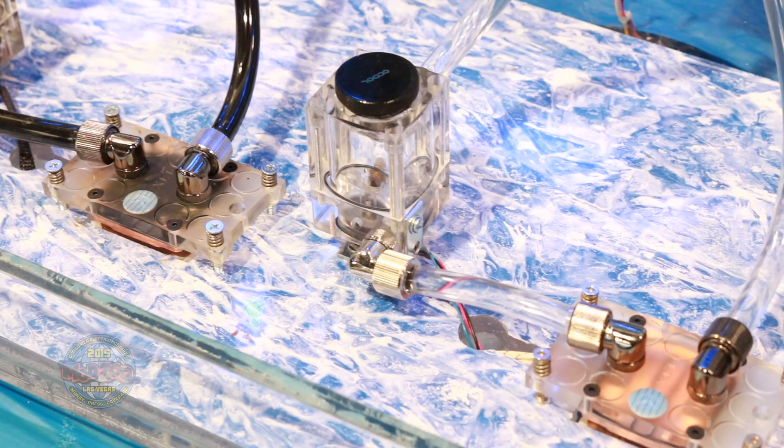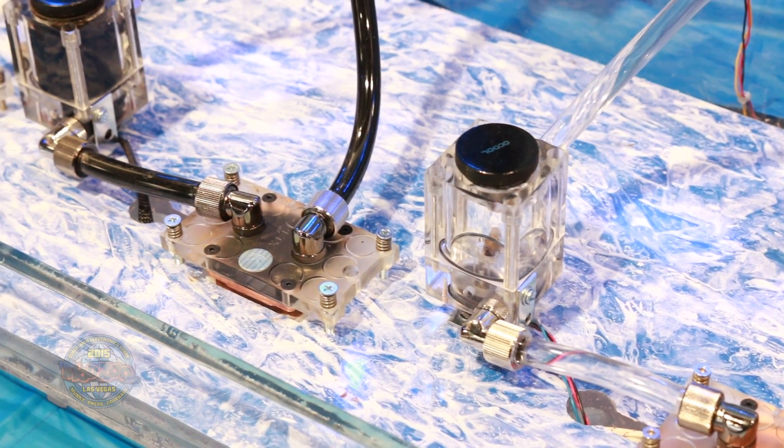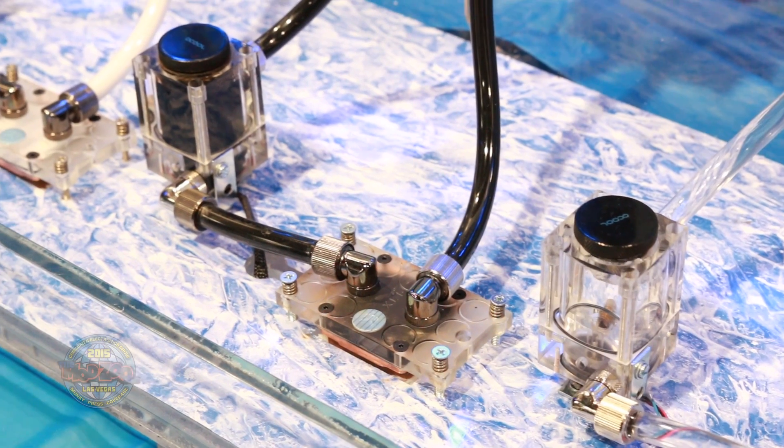And we also have the black. We've named this — as cheesy as it could be — Warrior. It's a new nanofluid. We're still doing a lot of QA on it; we can't control the particle size and that's become an issue. When we first tested it, it clogged everything right off the bat. We cleaned it up, ran it through some filters, and still had clogging. It's hard to find a one micron filter, but we ran it through some paint filters that are pretty strict, and that took out a lot of them. It's been flowing for two days now in our test loop, and we just have to work on the thermal abilities and get those dialed in.